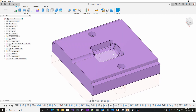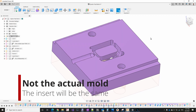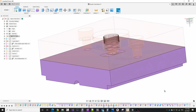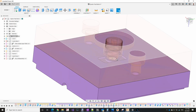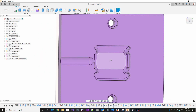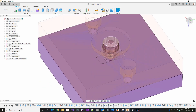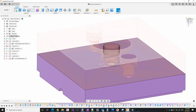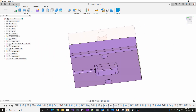I'm going to try a different mechanism — one where there's an insert that can be pushed out to push the part away from the bottom of the mold. Just pushing it a short distance is usually enough to release the part. The way this works is I'm going to have a screw that goes into the back as well as a spring. The spring will hold this in place when we start to inject the plastic, and then when you push on the back of the screw, the spring allows you to eject the part.